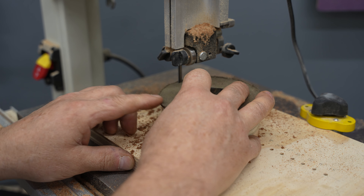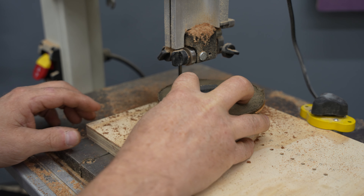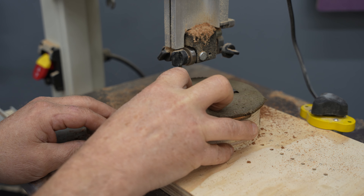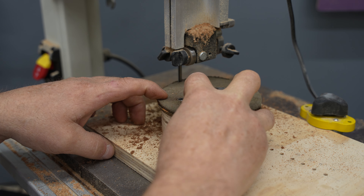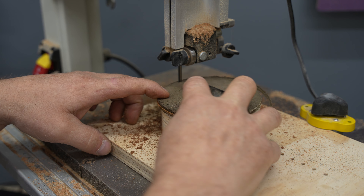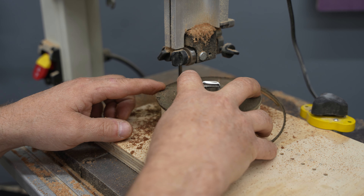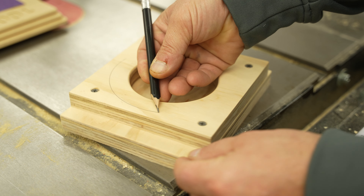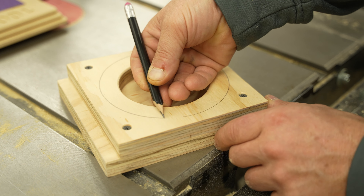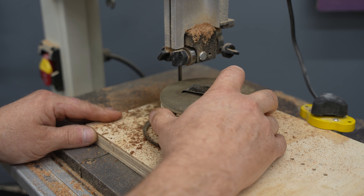This is where the molding jig came in handy, as I mentioned earlier. I used a circle that fit in the already-used form that I drilled a hole in the center of, and that hole will line things up on the circle cutting jig. This is why I glued the molds together — without the glue, once the circle was cut, the mold would have fallen apart because the screws were at the corners to prevent scarring the part when I molded it. This really worked out well and took a lot of the headache out of creating consistent multiple pieces.